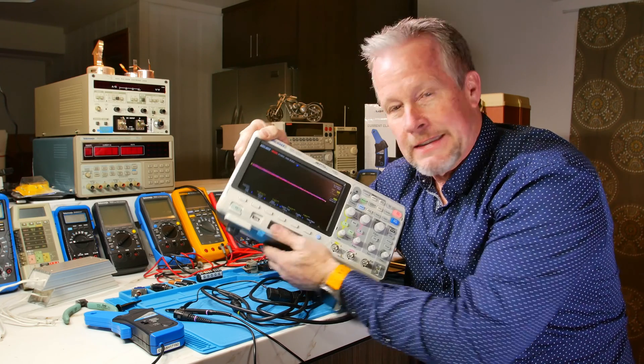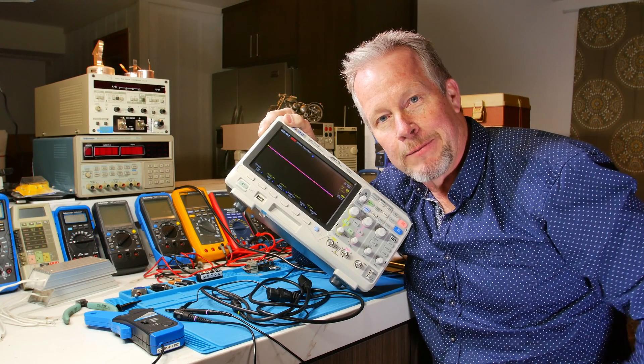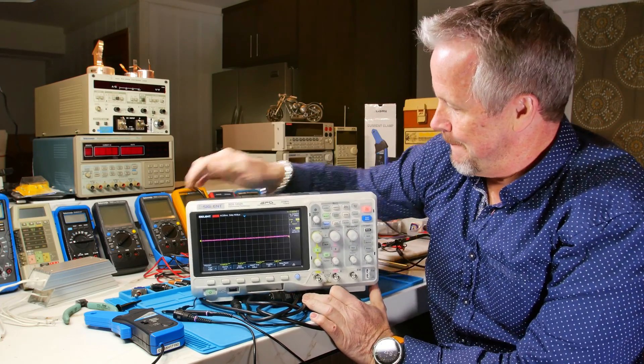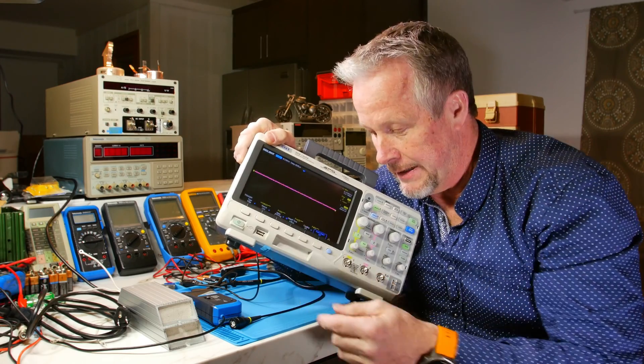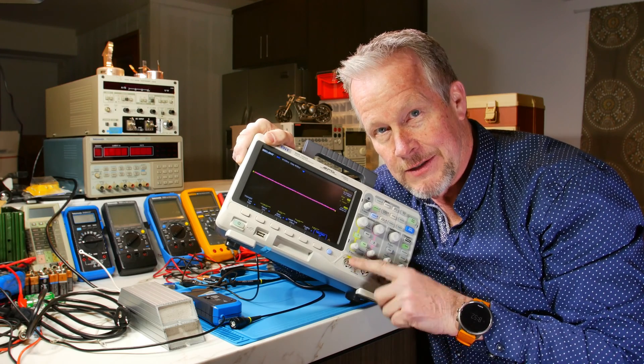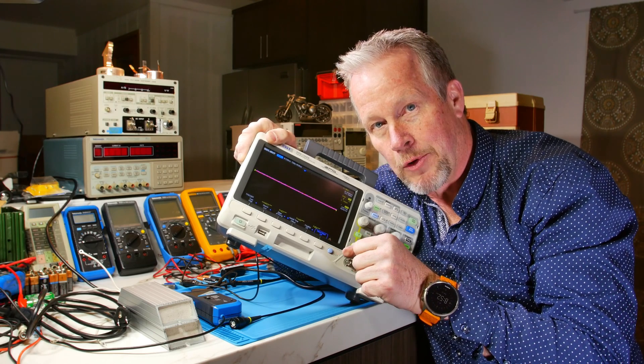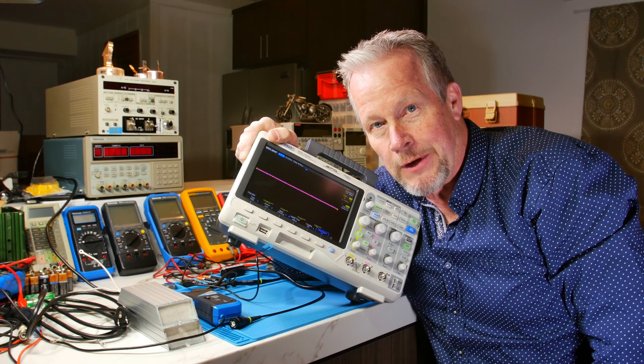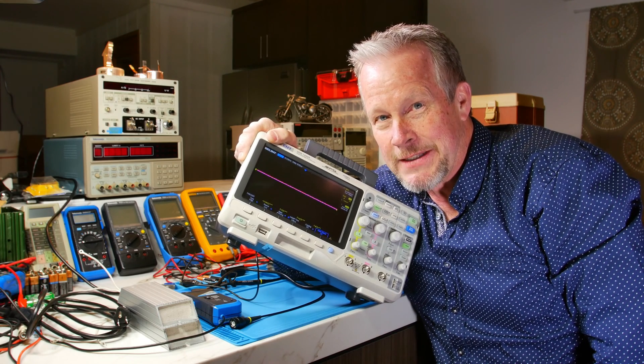Hopefully this little short video will help. Give me a thumbs up if you like it. If you guys are powered by AC power — the same thing this thing is powered by — then this is earth ground. So anything you want to tie that ground probe to had better be earth ground. That's the other way to short out the scope. That's probably the more serious way.